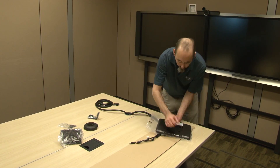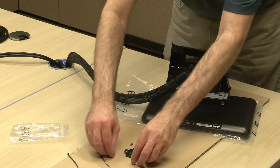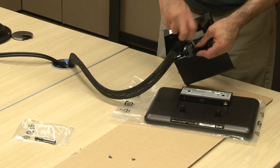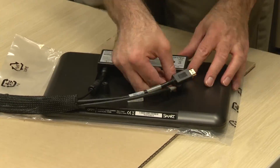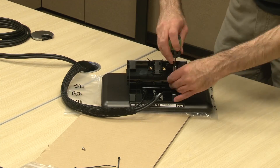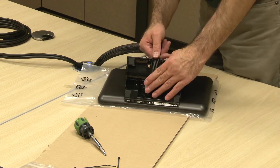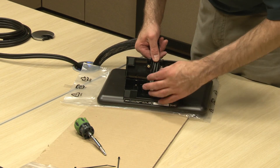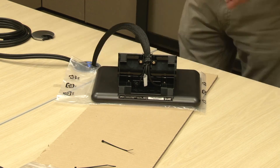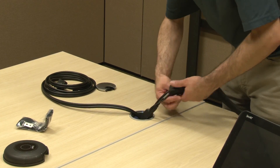Prepare the meeting room console, protecting its face from scratches or other damage, and feed the cables through the stand before plugging them into the console. Also, attach the cable management components and ties to the stand before connecting the cables to the console. Once the cables are connected to the console, secure the stand to the console and secure the cable and wire loom to the stand, making sure to leave enough slack in the cables to prevent them from accidentally becoming unplugged. Secure the other end of the wire loom with cable ties, leaving serviceable access to the location where the USB cable connects to the USB extender coming from the rest of the system.